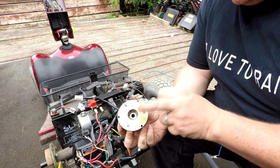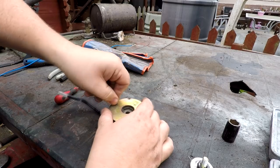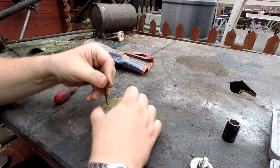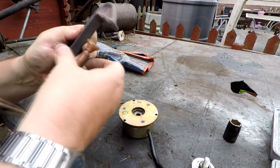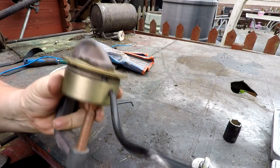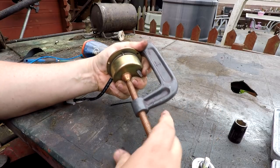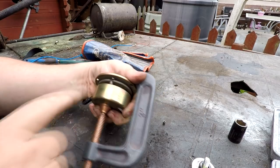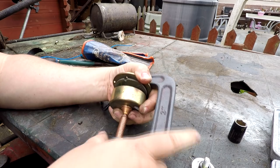I need to be careful — I should have safety goggles on, I don't know how powerful this spring is. I'll get a clamp to hold it in place. When anything is under spring tension you don't want to take any chances with bits that could fly out. By holding it in the centre it takes the load off the three small screws. Very gently unwind — it should just start to come up. Something just dropped out there — I think it's a little location pin. Yes, there are three of them. I think it's fully off tension now.